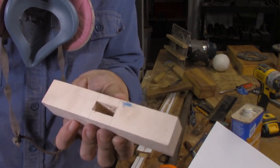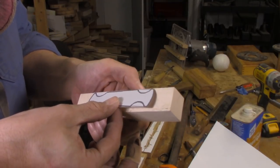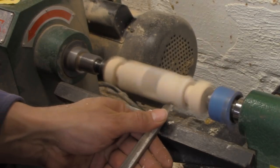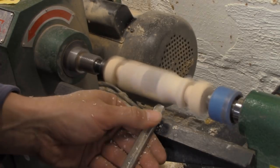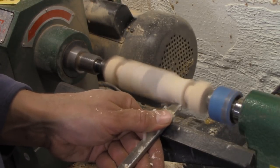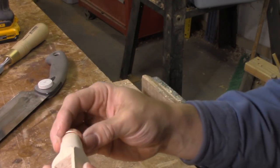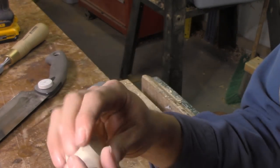Here's the completed cross piece. I widened out the mortise later so the sword could be full width the whole way through and not be weakened anywhere. I'm pasting on the template for the guard and then doing the shaping on the lathe using a detail gouge — it seemed like it would be the quickest and give me the smoothest results. I went with a smooth curve from the center down to the edges, and then a specific diameter on the ends so I can slip over bolsters made of copper. I just slice these off of copper pipe — they make it look nicer and protect the edges of the guard from splintering or damage.